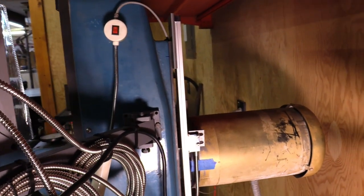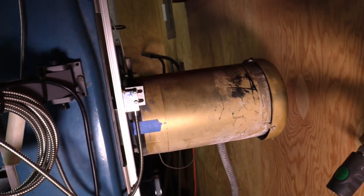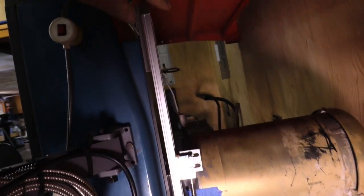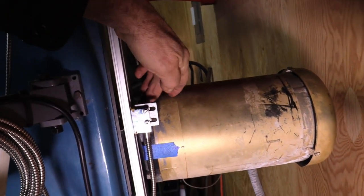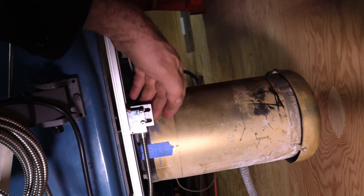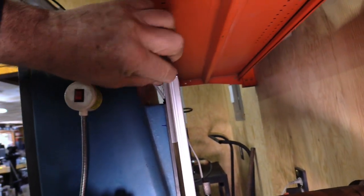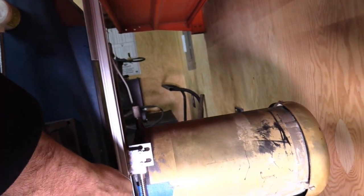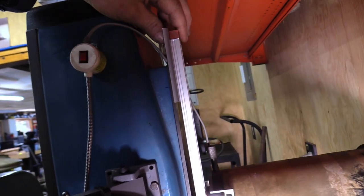Back here for the X-axis, this is the motor for the spindle. I mounted the scale on the stationary part here also. The scale is mounted to one of the motor mount bolts here, so this actually worked out really pretty good. I had to build some extension parts so I could use existing screws in this piece to mount it to, but this was a fairly easy install.